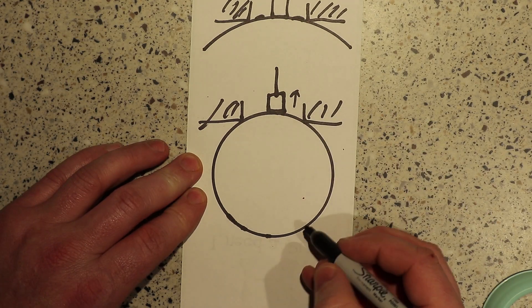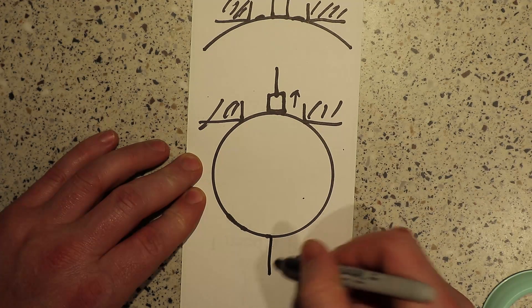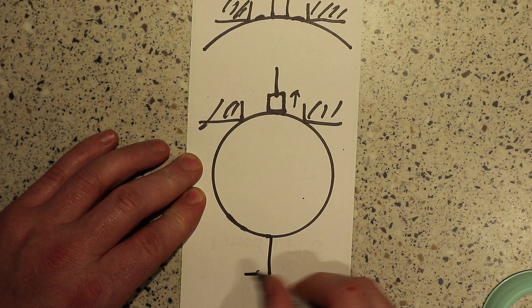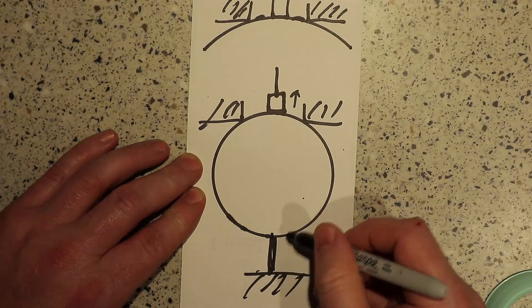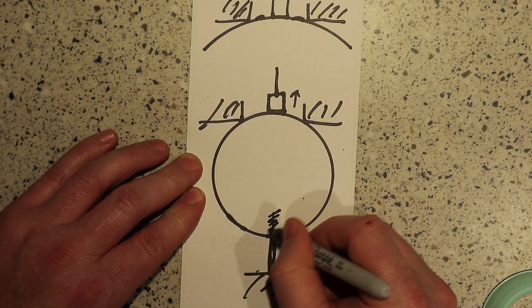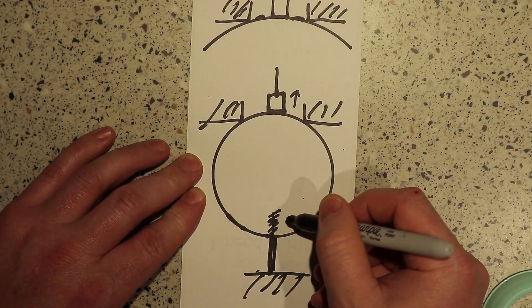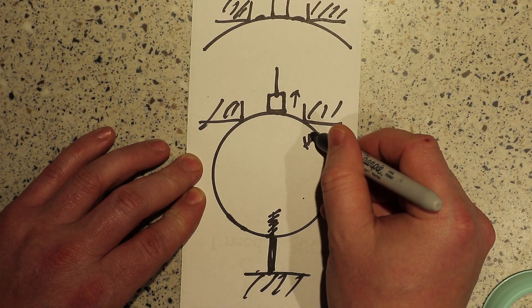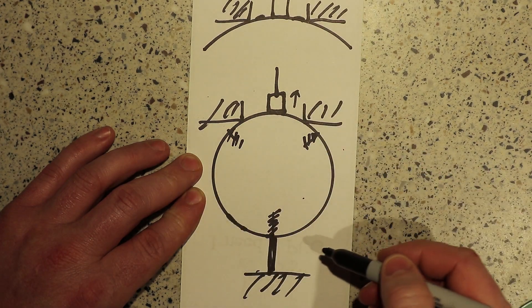To router this sort of shape — if you wanted to do a full 360-degree sphere — it'd be a good idea to mount it to the ground with a single post of some sort, probably threaded in. You'd probably have to do this in three or four different locations around the sphere so you can router multiple sides at a time.